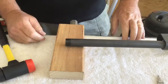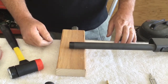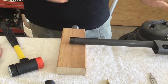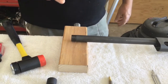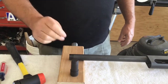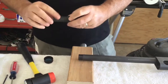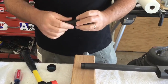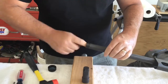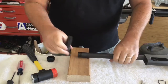There are several schools of thought about how to do this. Some guys like to grind out the dimple inside the tube with a Dremel tool, some people drill out holes to remove the dimple — all of those evidently work to some degree. I'm opting to go a different route by using this swage tool put out by XS Sights, which is going to allow us to remove these dimples with a little bit of pressure. I'm going to put some oil on this tool and lube up the inside of the tube, since there's going to be some pressure as we push out that metal and we don't want them grinding against each other hard.